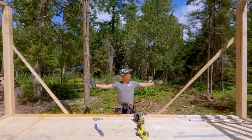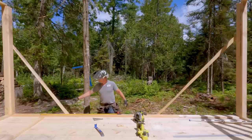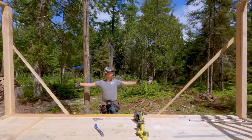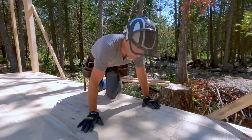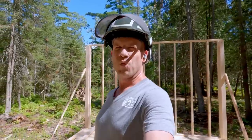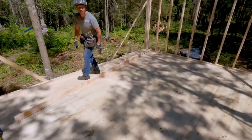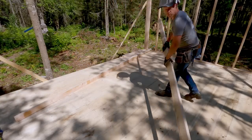Let's go three studs in - it'll be there, 60 inches? Or should I move it back a little bit? I've got to admit, I'm getting a little tired of climbing up here. Should probably take a minute and build some steps, but I don't want to. I think we'll just barely get twelve inches out of it for the header. The header's going to be five feet three inches by twelve inches. If it's twelve inches tall, it'll come out at the same height as the first window in the front wall.